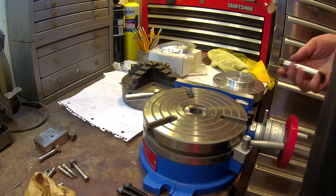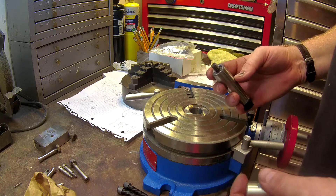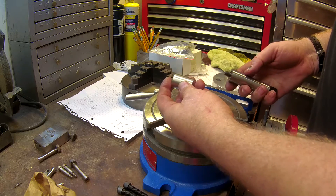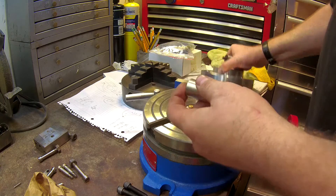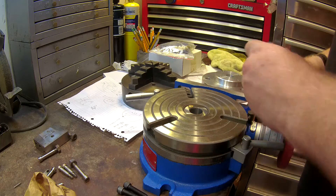So let's show how this all goes together. There are a few mistakes here. I purchased this arbor — I didn't make it, although it might be an interesting experiment in the future. It's got 3/4-24 threads, so I made this cold rolled steel slug to match the diameter of this for alignment, so that I wouldn't have to struggle to center this as much — should be within a few thousandths each time.